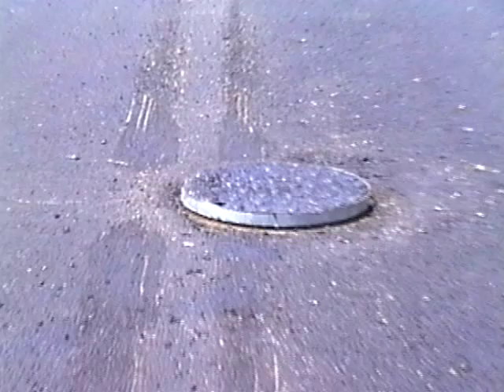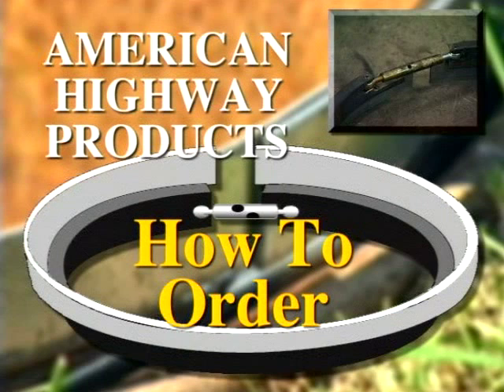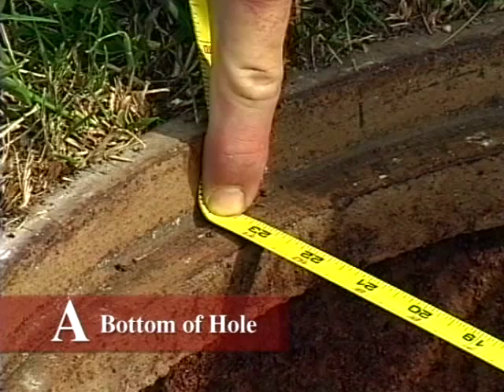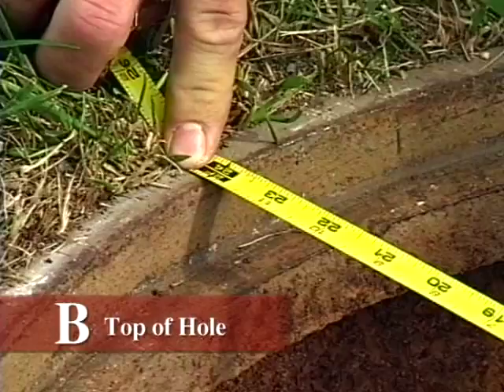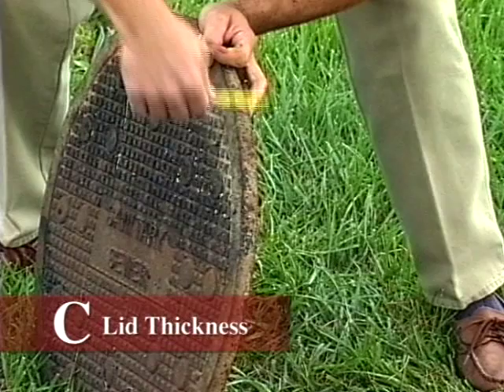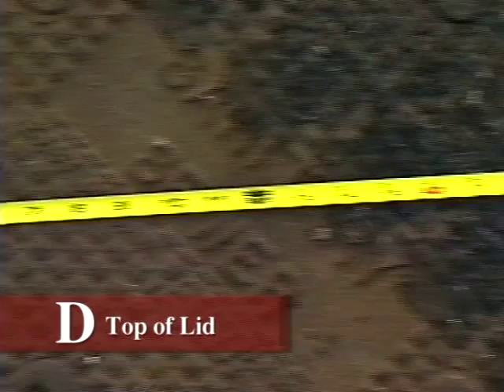Ordering a Pivoted Turnbuckle Steel Expandable Manhole Riser from American Highway Products is simple and only requires a few dimensions from your existing frame and lid. First, remove the lid and clean the frame. Measure the A dimension within the frame — if there is a normal taper of 3 to 4 degrees, the A dimension is not needed. Measure the B dimension on top of the hole opening, the C dimension or lid thickness, and the D dimension or lid diameter. You will also want to determine the riser height and any descriptive information that will ensure proper installation.